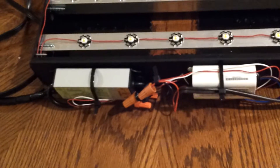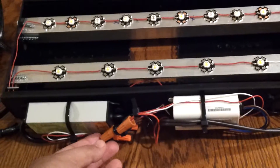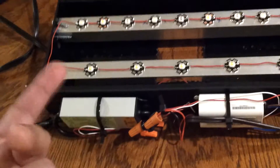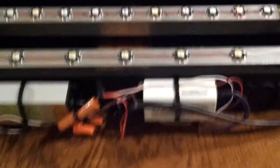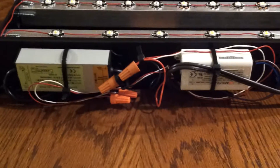For cables, I used a household cable from an old computer, spliced for one driver. For the other driver I used a lamp cord — I soldered those two together and used heat shrink tubing. Then for the driver-to-lights connection I used wire nuts, just in case I want to move things around.